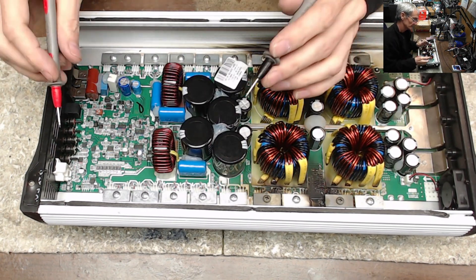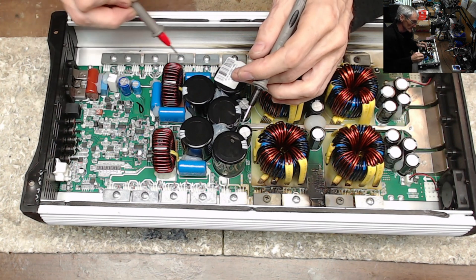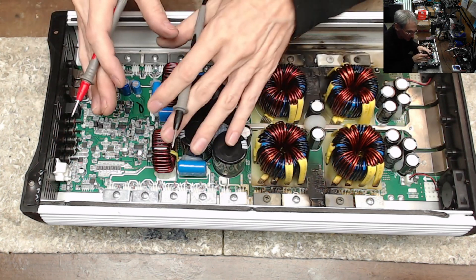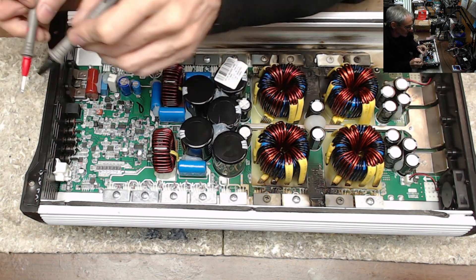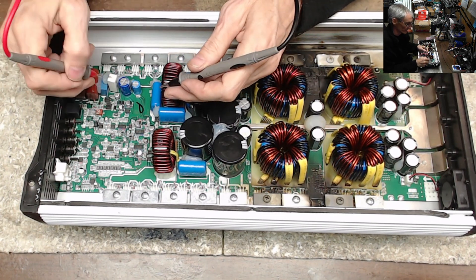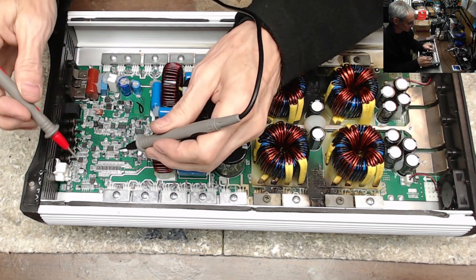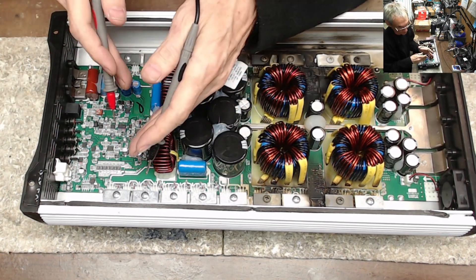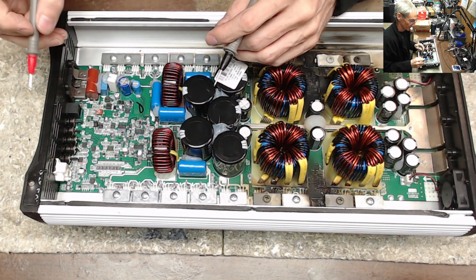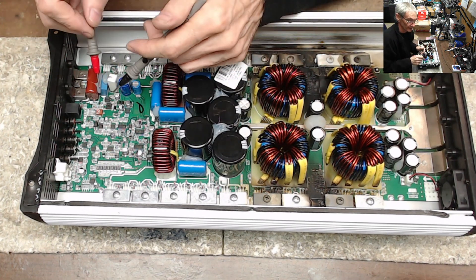There are instances where the preamp section is damaged from a shorted RCA or whatnot, but this will usually go into protect when you fire it up. If you showed 9.9K across the board on your output transistors but the amplifier still goes into protect, then you have to go in here, move your solder bridge, put it in shutdown to fire up your preamp without firing up the amplifier. There are other steps you have to take to check the preamp section — usually that's going to be your 319 and these ICs here. If there's a short in the output, they'll pop a resistor in the feedback circuit, and the amp would go into protect.